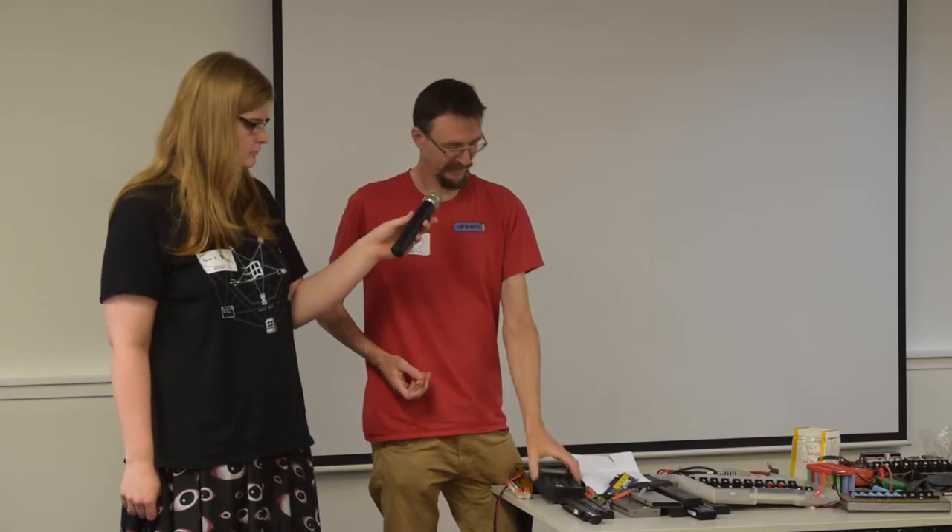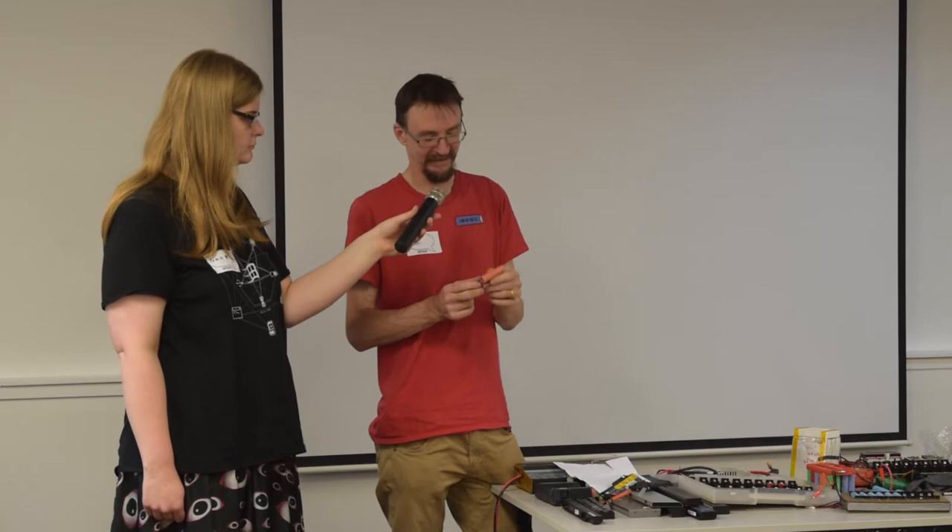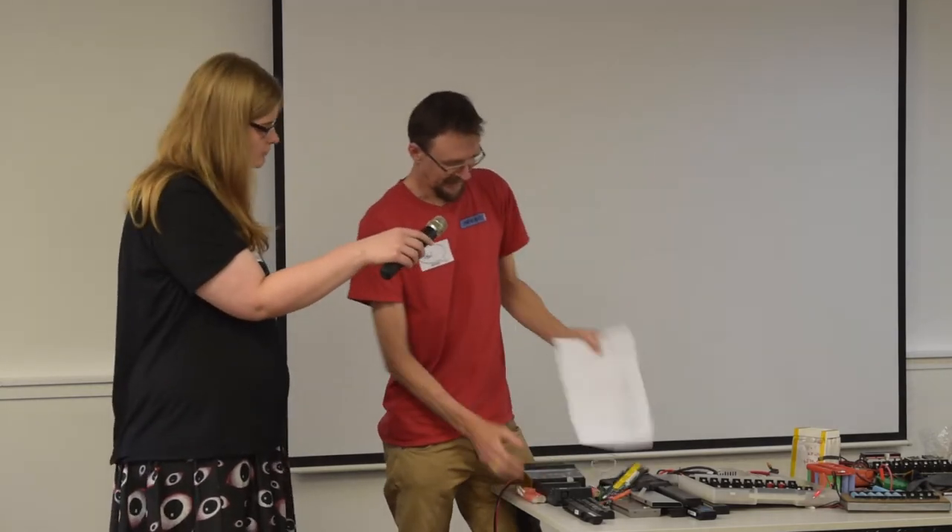This is kind of time consuming, so some people prefer to buy brand new cells. But you can buy a whole lot of these and do them all in parallel. You work out your capacity — there are numbers on all of these cells and you can look up what the original capacity was, then compare that to what you measured. If they are close, you know you've got a really good cell. If it's half what it was when it was new, you know you've got a cell that's on its way out. That's a good process.